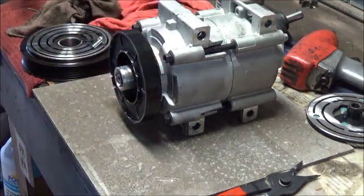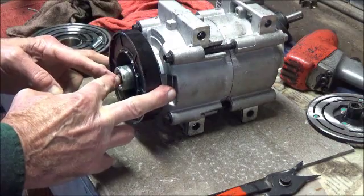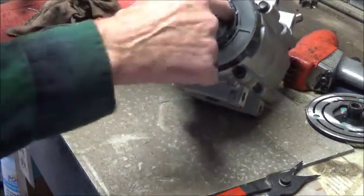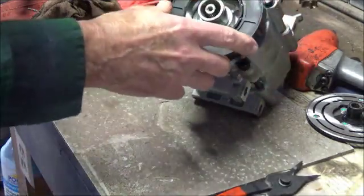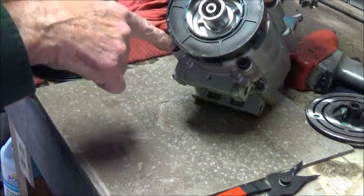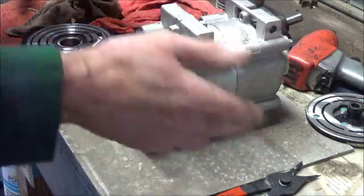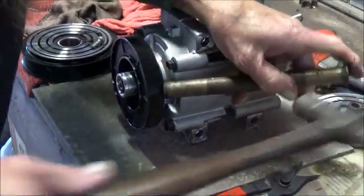About these magnets here — when you're pulling them off, and why I do it the way I do it: if you use a claw puller and you're pulling or pushing on that shaft, it's not really good for these bearings inside here. Number two, what's happening is you're bending it out, which is causing that ring — which presses on there — to kind of even grab tighter coming off. I'm sure they make some kind of a horseshoe plate that will have a puller going onto this area, or some type of a puller that doesn't push on the shaft. This is why I use a brass punch to knock that off of there.